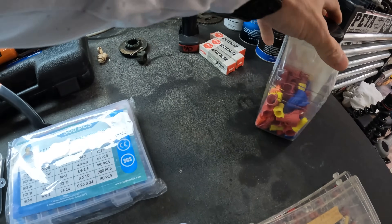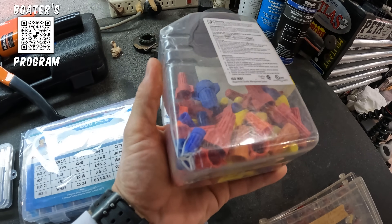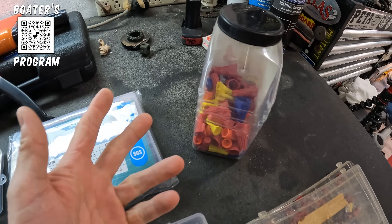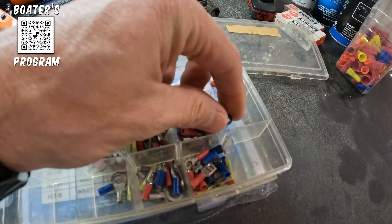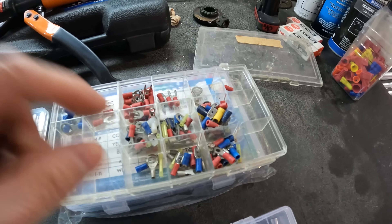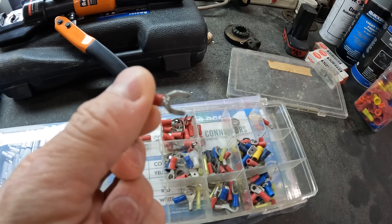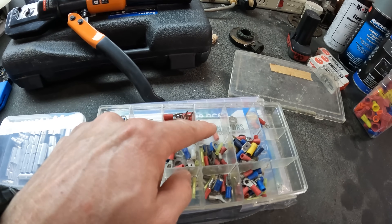If you ever want to have an electrical problem on your boat, then have eight connectors on two wires between two lights. That's a very bad thing to do. That is why we're going to go over all these connectors, the different ways to crimp them, where to use them and where not to use them. Anything like this should never be used on a boat. People will take a wire nut, put two wires together, then put silicone in the cap to waterproof — never do that. None of this should ever be on a boat. That connector is not waterproof; it's just a failure point. An open ended connector is a bad idea for a boat because a boat is always moving and these will eventually loosen up.